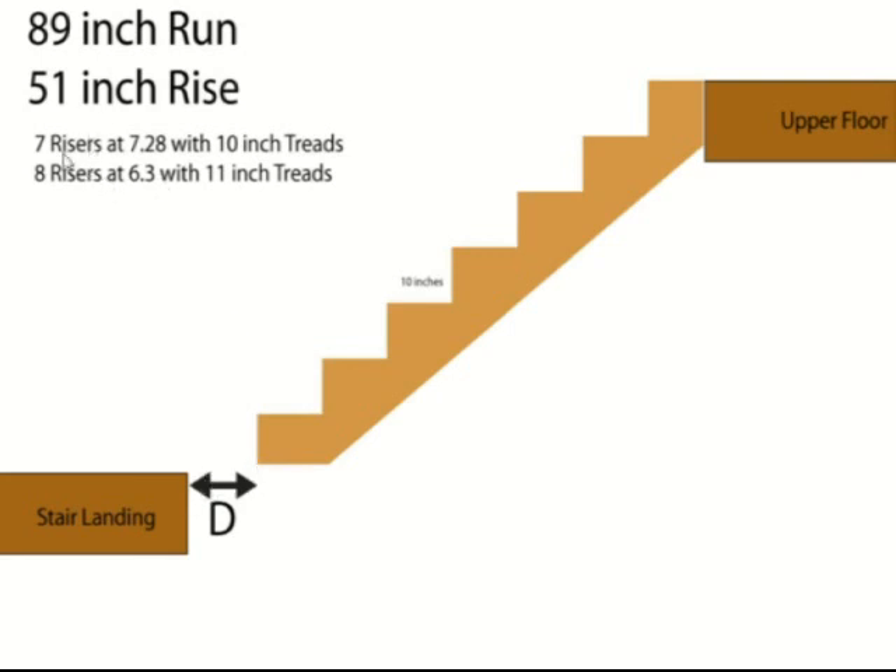You're in luck. It looks like you might have got the stair landing height close enough, because when I divide 15 risers into the overall height of the stairway — which is 108 inches — I ended up with a 7.2 individual rise, so we're close right here.